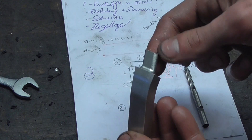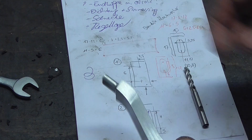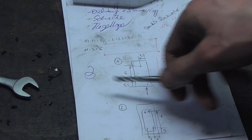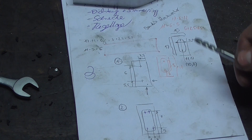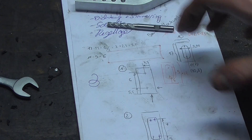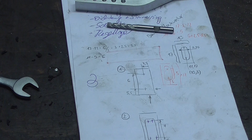These pieces have a radius right here, and to mimic that I'm going to chuck up a countersink and countersink the pocket so it doesn't interfere. I have marked out the coordinates here — just to eliminate any possible confusion, because I am way out of practice on milling.